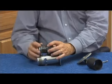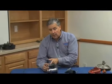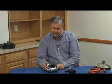So this area is open to atmosphere, which is important because that means it's sitting over here. Anybody puts grease or anything along here, what happens to grease when you leave it sitting out? It'll dry, it'll cake across here and cause the relief valve not to open. So it's non-hydraulically balanced. Hydraulic sensing line on the cover, we mentioned that.